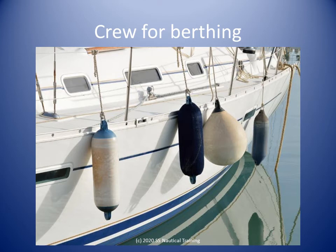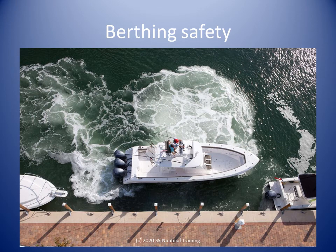The helmsman's instructions should be given beforehand whenever possible and understanding of the instructions checked. Ideally, there should be two deckhands. Prepare the mooring lines beforehand. Position the fenders and have one roving fender. The crew should follow the helmsman's instructions and beware of contradictory advice from ashore. The crew should call out distances to the helmsman as required. Do not allow the crew to manhandle the boat; always use fenders and/or a boat hook.